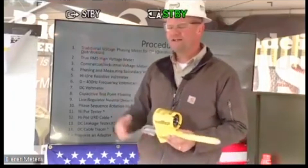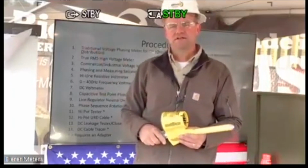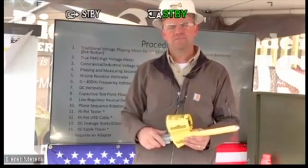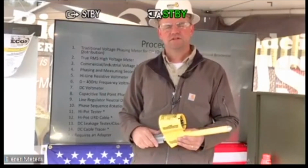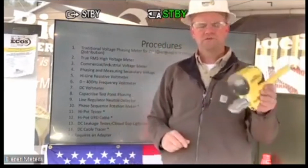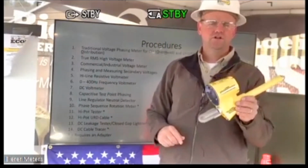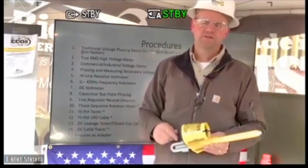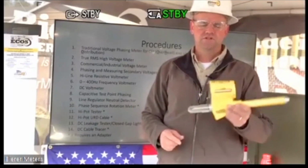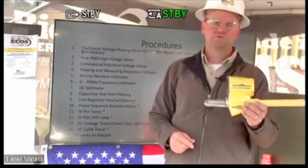We actually have a Cooper regulator here in our training yard that's attached to our line coming in, and we can go in step or out of step and determine if it's accurate versus what it tells us. So again, with the accuracy of this tool, if it's a 5/8 per step, around 45 volts per step, thereabouts, you can actually see that with this tool.